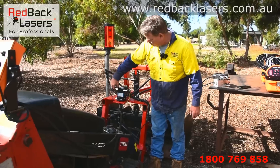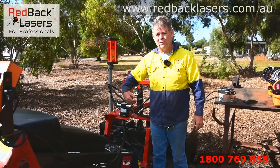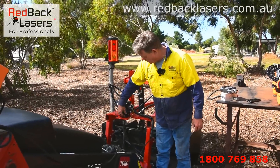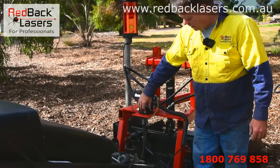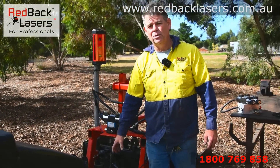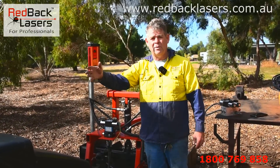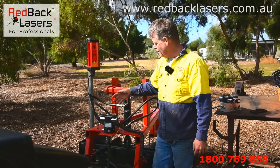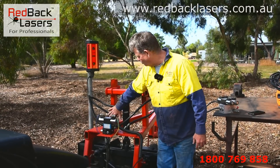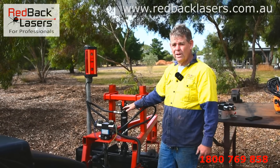So what we've got here is our solenoid control valve. We're going to dampen it to slow our hydraulic flow rate down a little bit, because I've got no way of slowing that flow rate down on this machine. Then our hydraulic block, which has two live feed hydraulic hoses that go into our auxiliary hydraulic system. We're going to lock off our hydraulic flow into live flow, and that's just going to run a loop when not in use. Then your two hydraulic cables going up to your ram in the raise and lower position.